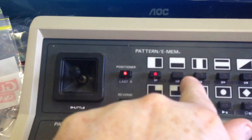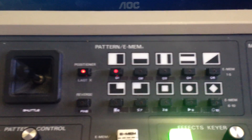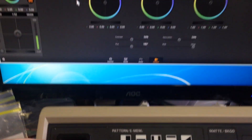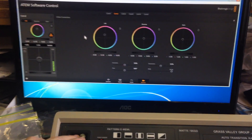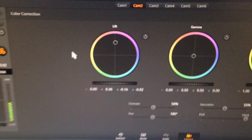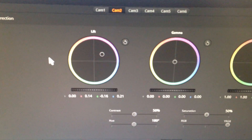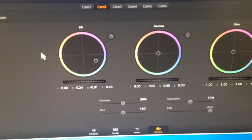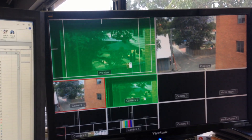There are two ways to adjust color. With a pattern selected, the joystick no longer controls iris and black level — it now drives the color wheel, as you can see on screen. Moving the joystick moves the color wheel position, so you can do DaVinci-style color correction using the joystick on the GVG panel. You can see all the colors changing around the color wheel.